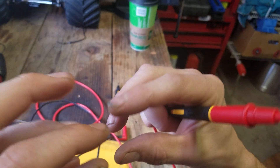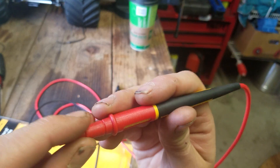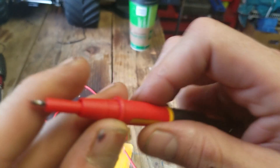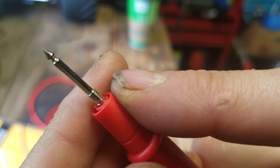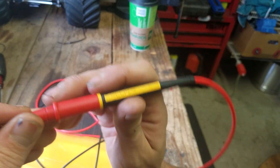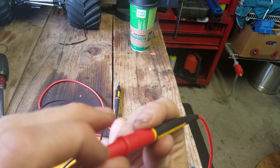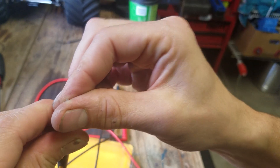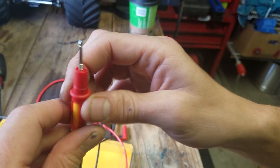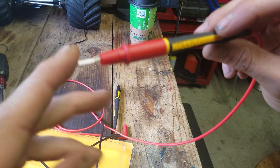There are a lot of tight spaces on control wiring, any kind of low voltage wiring. They've been making that stuff smaller and smaller every year, to where you're five millimeters away from another circuit that you shouldn't connect. And that little sleeve makes it really easy to hit your target. Also, when you have the sleeve all the way down, it's threaded there, and all of the Fluke accessories that screw on to this threading all work with these leads. I have the little hook grab-on leads and the alligator clips — I think I have two different styles. Even one that's not Fluke still fits these threads. Not just the slip-on type that can come loose — this screws on, so it's not going to come off on you. They're a little tricky to get screwed on sometimes, but those little alligator clips are worth their weight in gold when you're using these kind of leads.